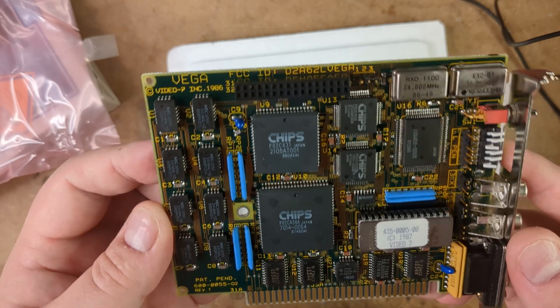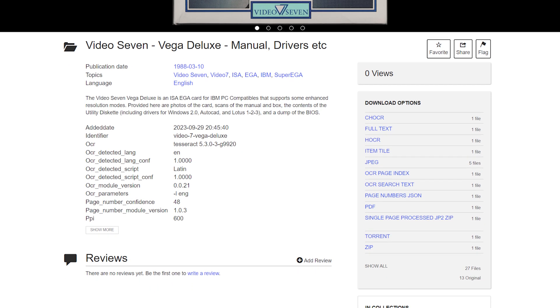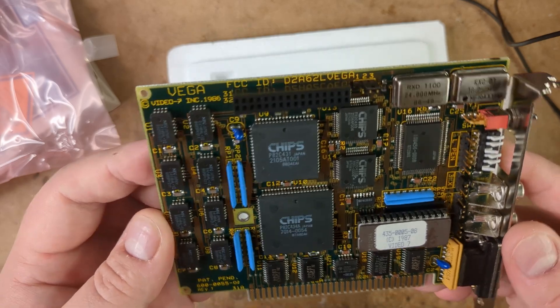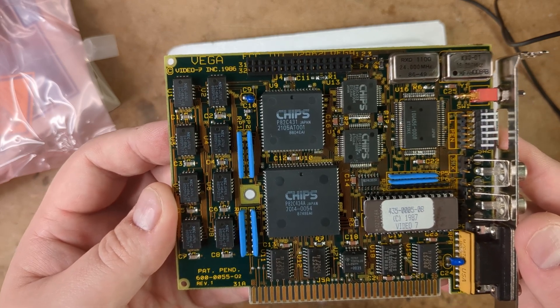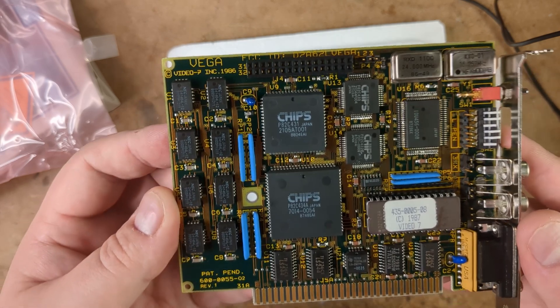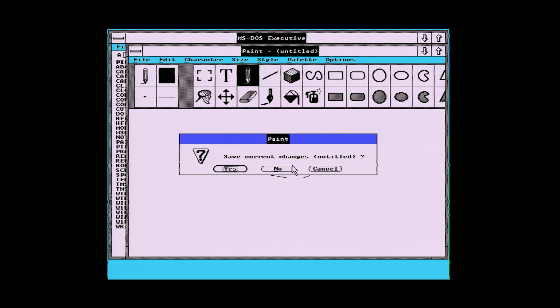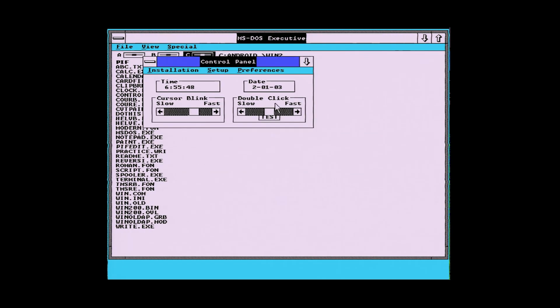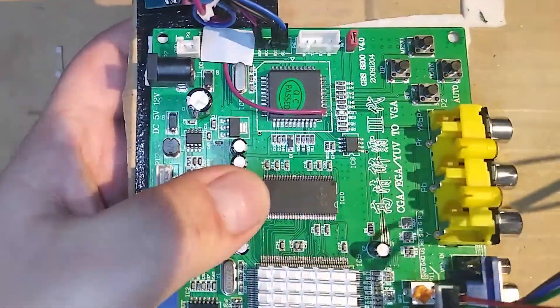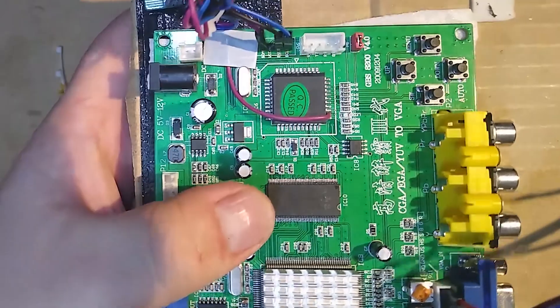Alright, I think we've covered most of the features of this card. I've scanned the manual and copied the utility discs to the internet archive — there's a link in the video description. I'd be very interested to see if someone can use the Vega Deluxe BIOS and utilities to make a standard CS8240 card into a Super EGA one. The extra features of this card probably aren't too useful for most people other than as a curiosity — as far as I know, there weren't any games released that used these weird graphics modes, apart from possibly some very basic VGA games using the card's VGA BIOS emulation. Getting a picture out of this thing can be a little tricky, although fancy upscalers like Retro Tinks and Frame Meisters would do a much better job than this $20 GBS board. Anyway, give me a thumbs up, leave a comment, subscribe, and I'll try to have another video out soon. Catch you next time!